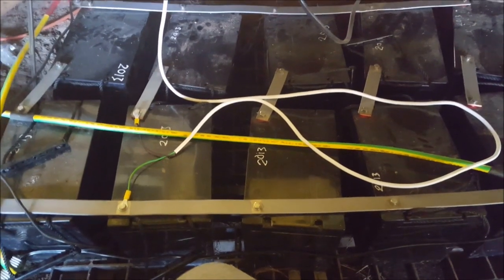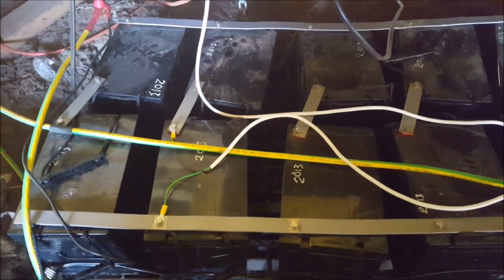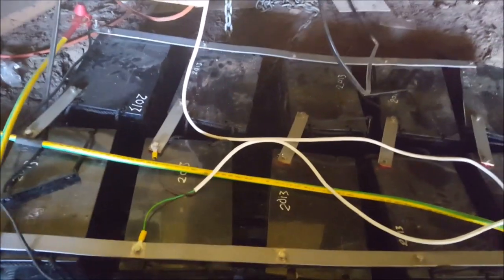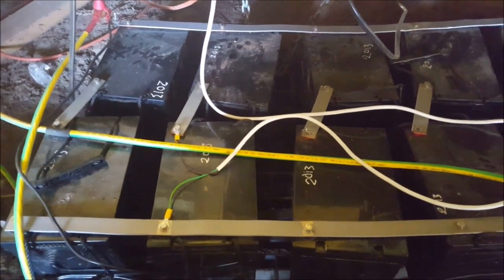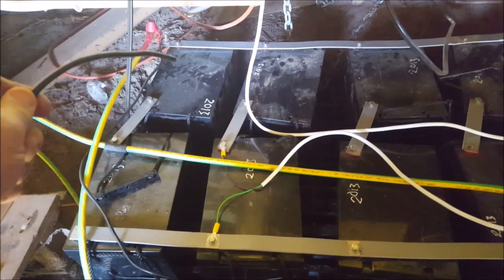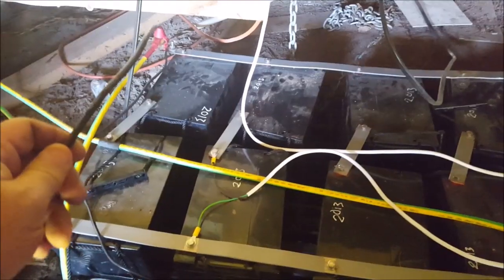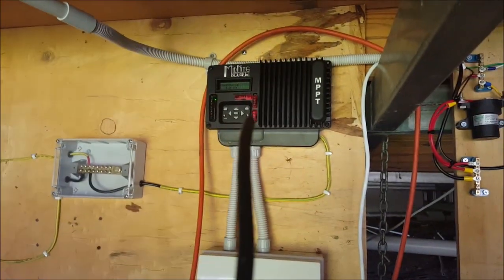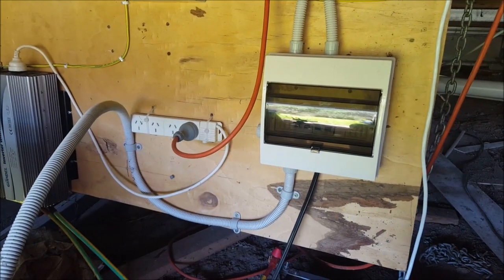They were installed into a shopping centre in 2013. I had them off charge for about nine months and they're doing fairly well at the moment. I've got them set in series-parallel for 24 volts — busbars linking them up. Positive over there, negative over there to the inverter. Inverter there, ground, earth, charge controller, isolators, circuit breakers there, power to the rest of the house.